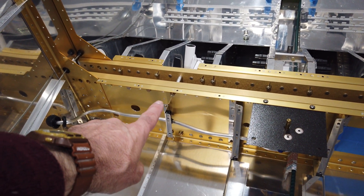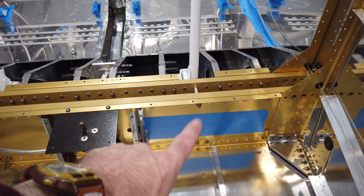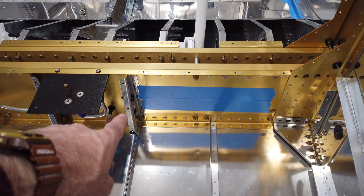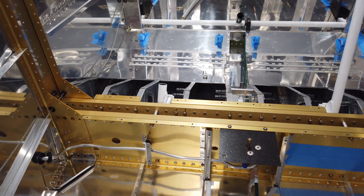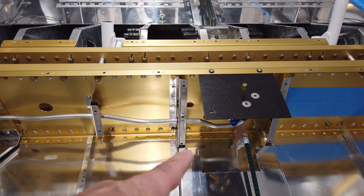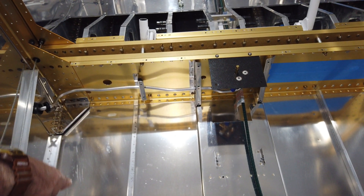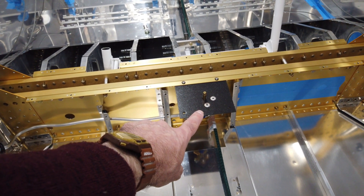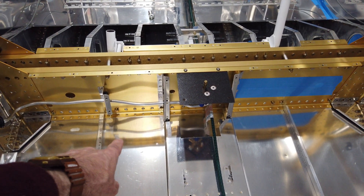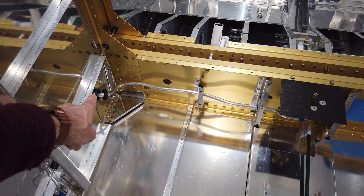You also have to do a 90-degree bend to get the line up to the valve. I'll document what I'm talking about with this valve. Note this little bracket that mounts to the spar — I have it off on this side. That's where you want to start: take that bracket off, it gives you more room to work, and when you slide your line around you only have to feed it through one bracket instead of both. I made my bends for the valve outside the airplane, then brought the line in and fed it through the hole.